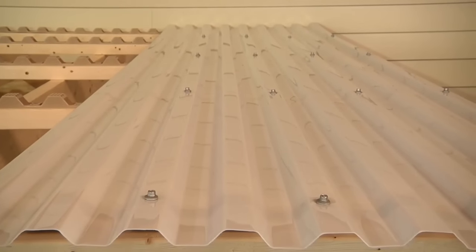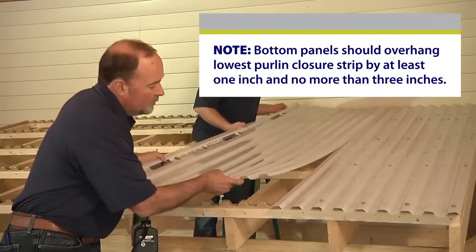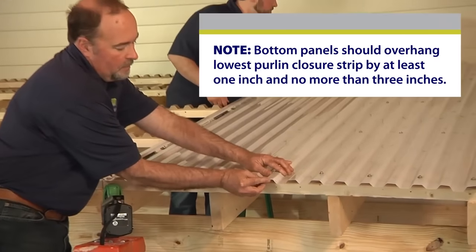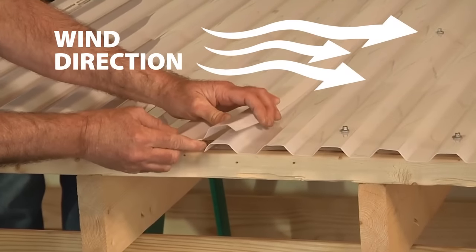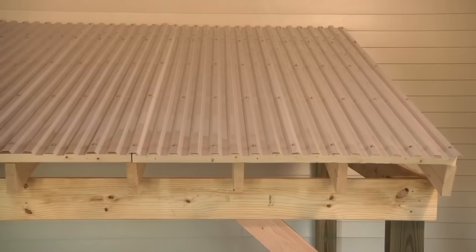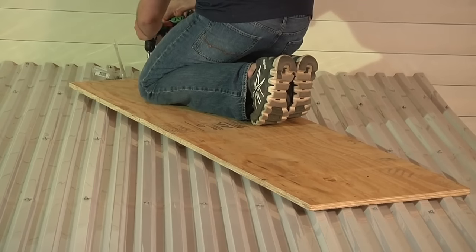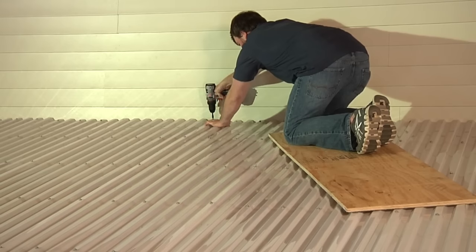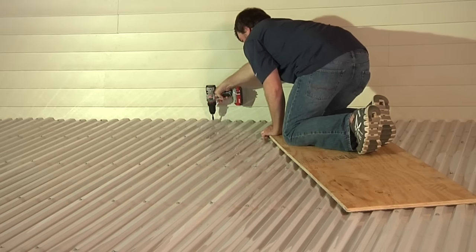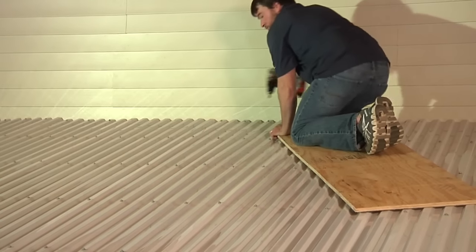Also, if you plan on installing head wall flashing, do not install the top row of fasteners until after the flashing has been properly installed. Position the next SunTough panel — it is critical to overlap panels at least one corrugation. Make sure the panel overlap is facing away from typical prevailing winds. Do not step on installed panels between structural supports. If you must walk across installed panels, use a sturdy board long enough to span three structural supports and strong enough to support the weight of the installer.